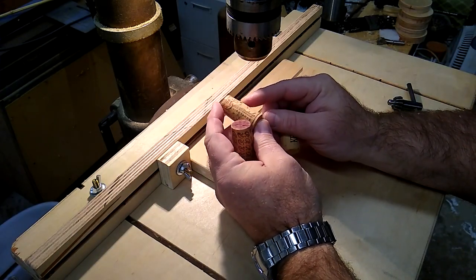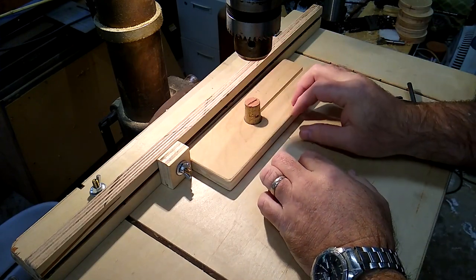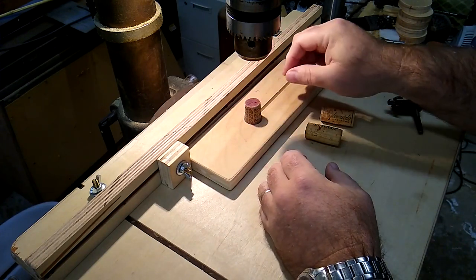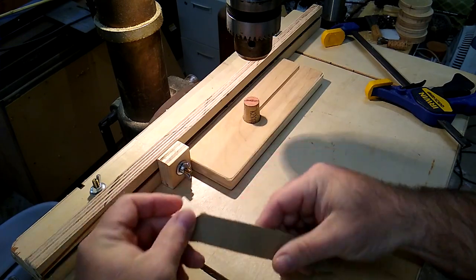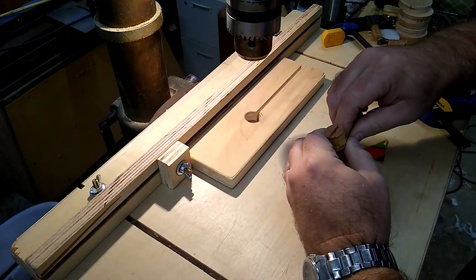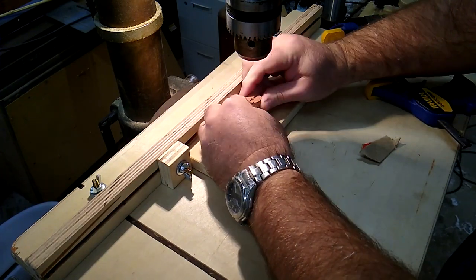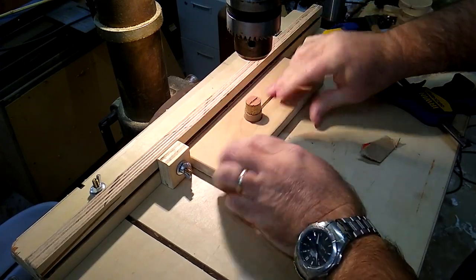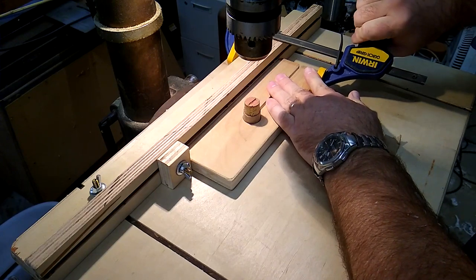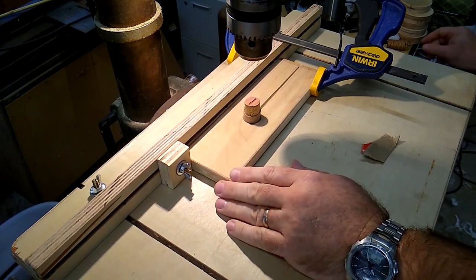With the slot cut in this jig, you'll be able to clamp one end against your table fence and it will squeeze down a little bit on the cork. If you have a tight-fitting cork, this will be plenty to hold it. If you don't, you can wrap a piece of cardboard around it — just don't overlap it, because that will change the center location of the hole in relation to the outside diameter of the jig. Leave it open on one end where the slot is, wrap it around your cork, drop it in place, and clamp it down. The hole won't be exactly perfect — it can be off just a hair on the exit side — but the cork is plenty big around, and I'll take enough off the outside diameter to make it more concentric with the center hole.